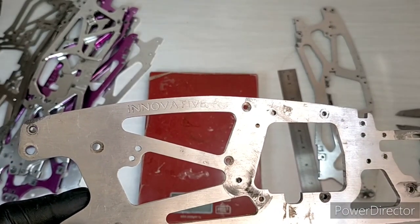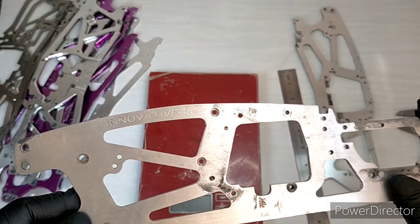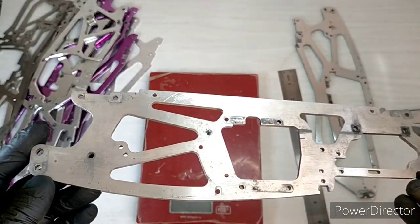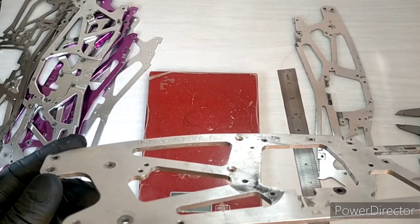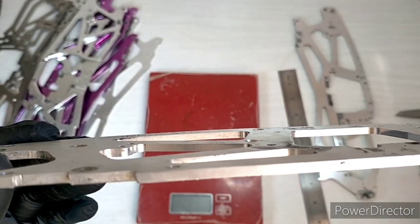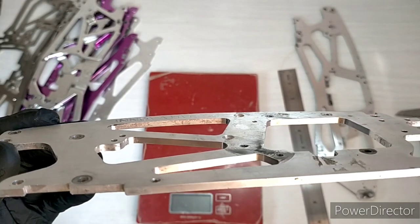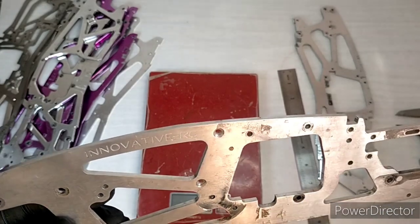This is made out of a nice piece of aluminium. You can feel in your hands that this is probably a graded or heat treated piece of aluminium — possibly something like 7075 heat treatment or 6061. Looking at the edges, you can see this has also been machined out of a piece of billet or sheet, with the cutouts machined out.